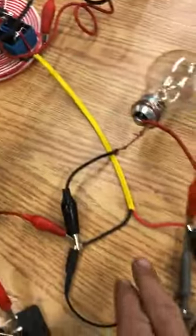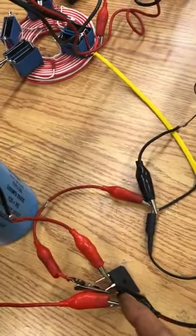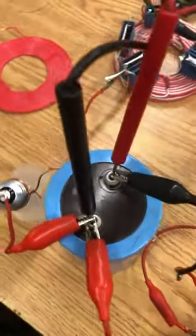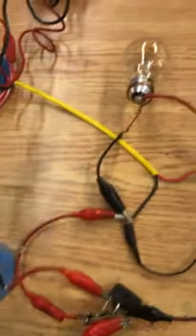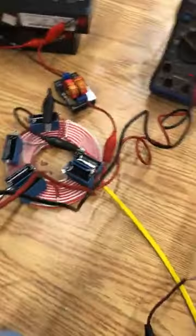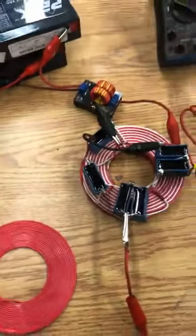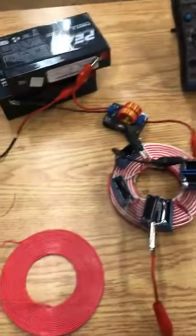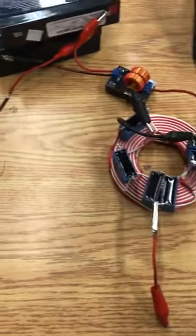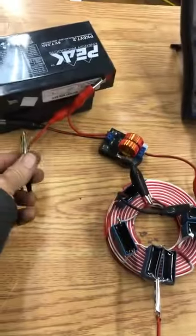The output of the device comes here. I have my oscilloscope across it, a light bulb across it, a bridge rectifier across it, and a big capacitor across it, with another light bulb to empty the capacitor. This does not function the same as on the induction cooker, and there's a variance in the frequency, a slight difference in the wave. It does not perform the same, however it does perform — just not near like the induction cooker.